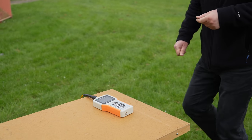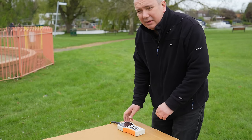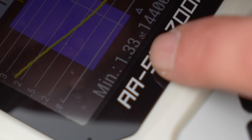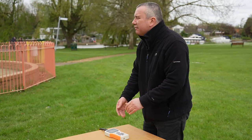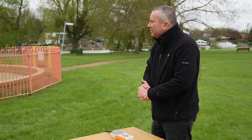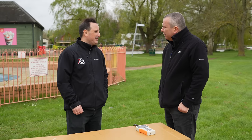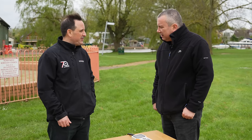Right, okay, so we've got the antenna up for 20 meters and we'll check the SWR. 1.3 to 1, that's not bad at all. Tony, what do you think of that for the 20 meter band? 20 meters sounds great, Richard. It does. But, you know, we're doing POTA. Yeah, shouldn't we really try 40 meters, work a bit of DX, etc.?